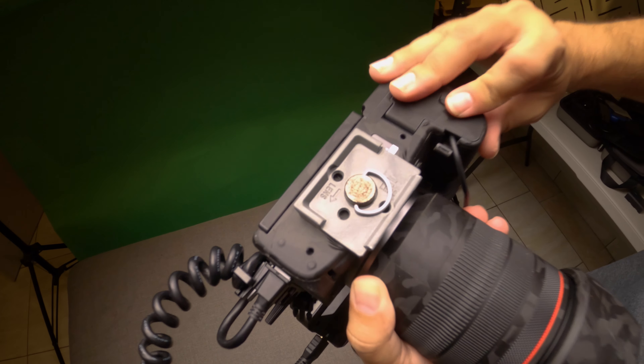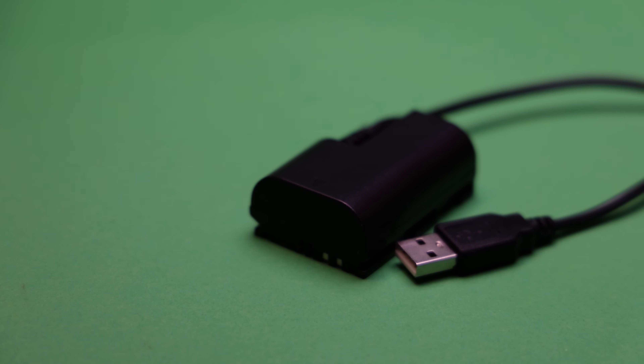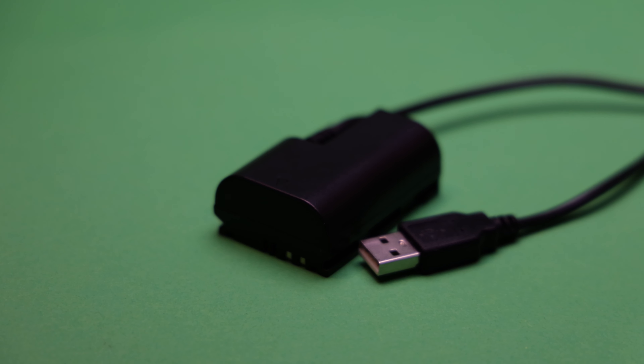Because if you buy a dummy battery that's not safe and does not regulate voltage, it could fry your camera regardless of model. I've seen R5s fried in videos because they were connected directly into a V-mount battery where voltage is not regulated. But with the correct dummy battery that regulates the voltage entering the camera, you can make sure that you will be safe.